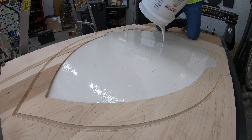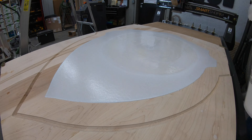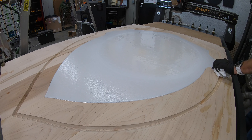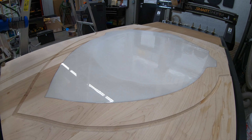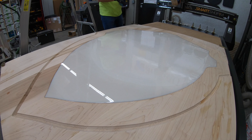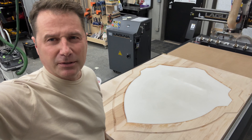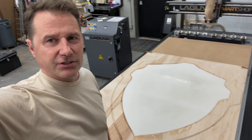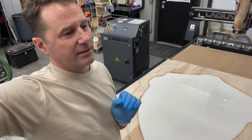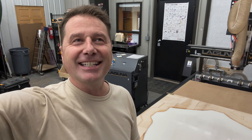Just pouring in all this epoxy. Epoxy comes in two parts — the actual epoxy and the hardener — and when you combine them it starts the chemical process of hardening; that's when the magic happens. I think this was a two-to-one epoxy-to-hardener ratio. I mixed up the epoxy for a couple minutes before adding the coloring. I have to pour this on a completely level surface, so the CNC table works really well — it's completely level and I can easily clamp down the board to keep it flat. I'm torching off all the bubbles and babysitting it as new ones come.